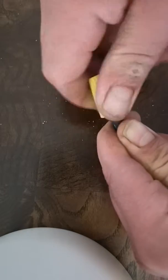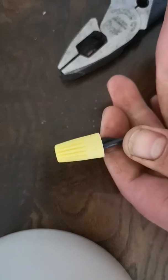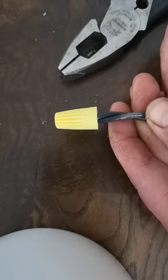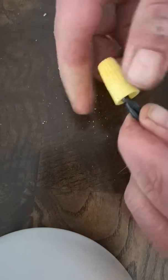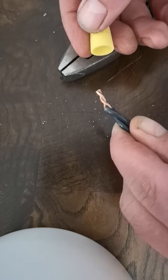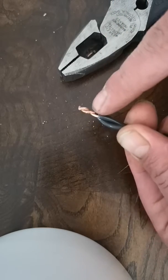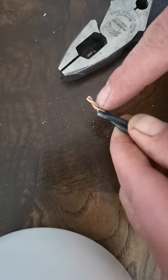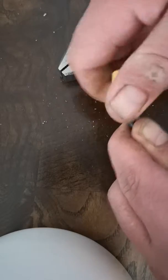Take your wire cap and put it on, twisting it in a clockwise rotation until the wires start twisting together well. There you have it — a finished proper connection on a 14 gauge wire. Twisting it off counterclockwise to remove it, you can see the connection is substantially well done — this is what you're looking for when terminating your wires.